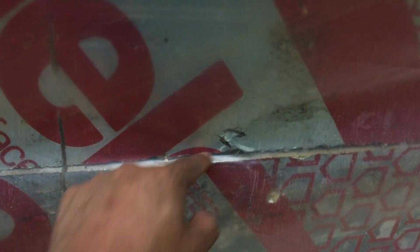This is where the customer told me that they fixed it. Why did they fix it? Insulation board. They fixed a bulging, and you can even see here the insulation board is also bulging as well. Sometimes when the insulation board is separated, like you see here, that allows the water to go behind the stucco and the insulation board, and sometimes the 2x4s are rotted. Once again, everything goes back to the old style construction. Chances are that this house doesn't even have insulation, and because of that, there's so much air behind the insulation board that even though this part right here might be leaking, chances are the 2x4 is in okay condition because of that air that is allowing the 2x4 to dry out.